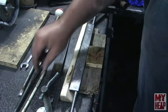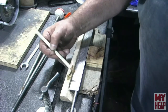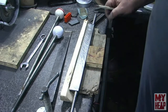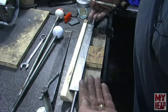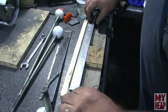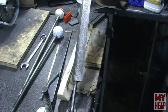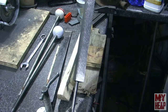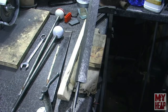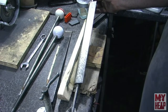After rubbing it down we take a look. I still have it on the end but now I'm starting to see it creep up here in the middle a little bit. Same way here - I've still got some on this corner and it's starting to move down. I'll progressively work that and eventually it will meet in. I'm just rough scraping to bring the bulk of the material down until it's flat, then I'll break up the little islands for contact points. The beveled edge side is pretty flat and marks real well. We're going to the steam festival starting tomorrow and Saturday, then I head home Sunday.